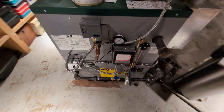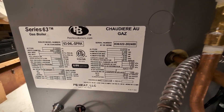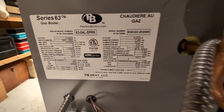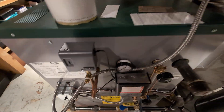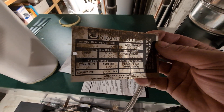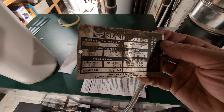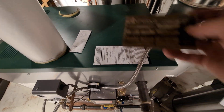What we have here is a Peerless 63 series — I think it's a 4L, which is 383 square feet of steam. This was the boiler that we replaced; I have a video of it, so I'll put the link below for you to see what was here before. We're looking at about 450 square feet for that old one, and that was definitely too large.